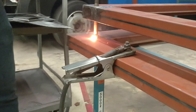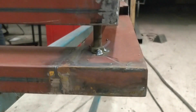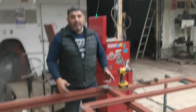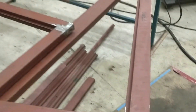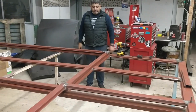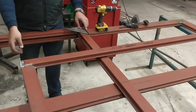After all that, we then moved on to do our first movement test. This was a bit more in-depth than placing some panels or stacking some frames. Hector just tacks a half-inch bolt in place — this is just a mock-up of what our hinge system is going to do — and we've just swung it out for the first time. This is hot off the press from the design studio. We're pretty happy because we did all this in SOLIDWORKS and now we get to do it in the shop. So this thing swings. This is the first time in reality that we've seen this thing working. What we're trying to define now is the point at which we need to link these — basically this thing slides out and these two are linked together with a slot and a pin.